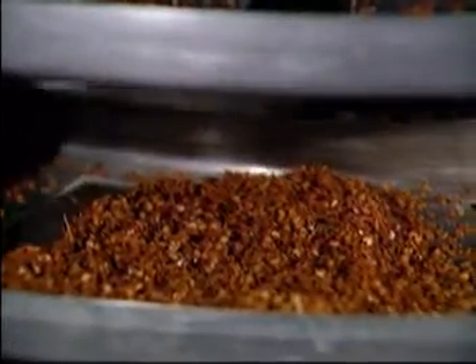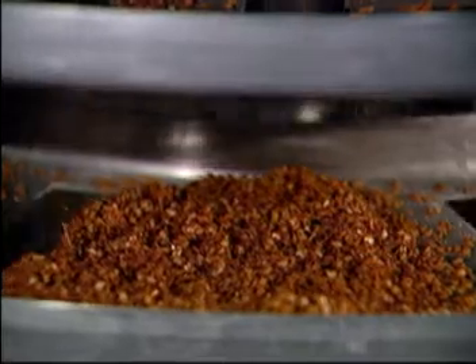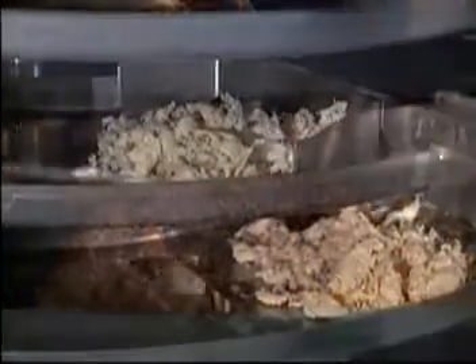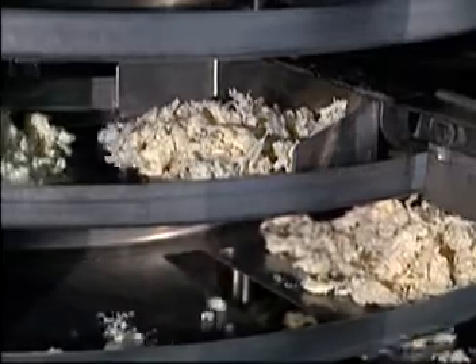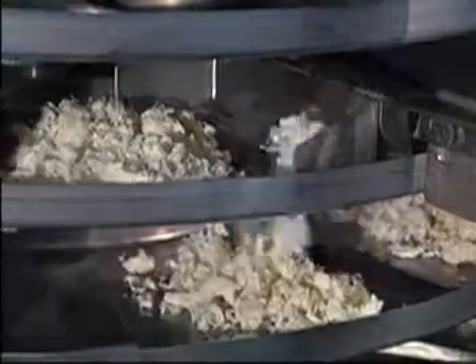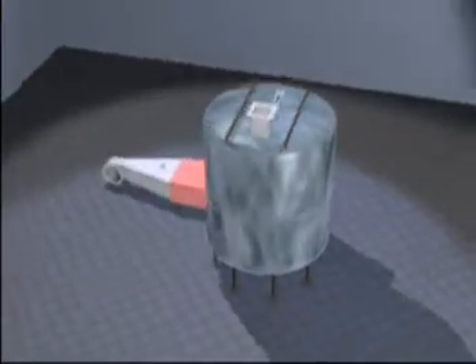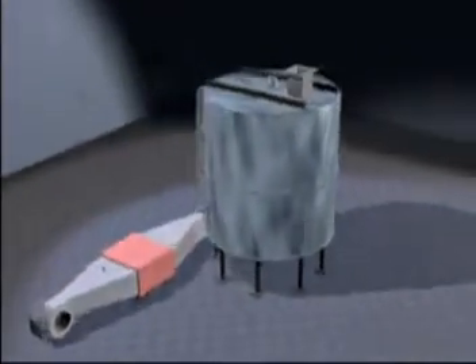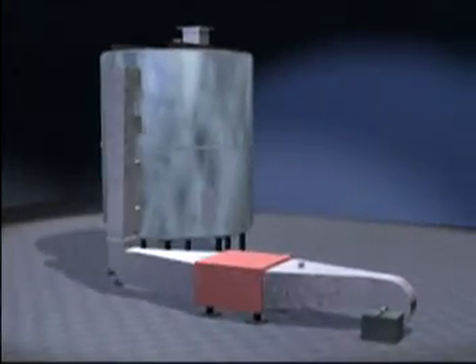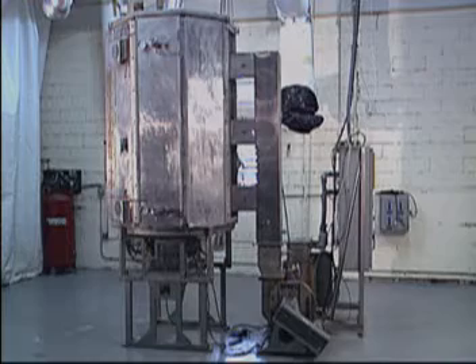The movement of the air increases the heat transfer, thus speeding up the drying or cooling. The rate at which the air circulates within the dryer is many times that of the air flow through the dryer. Because of the vertical construction, a very small negative pressure can be maintained inside the dryer, thus preventing dust from escaping through the housing into surrounding space.